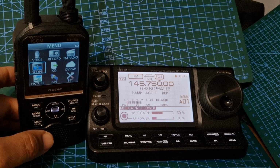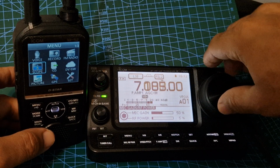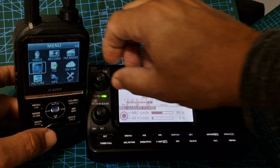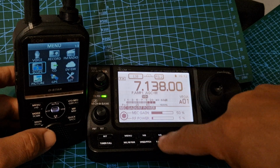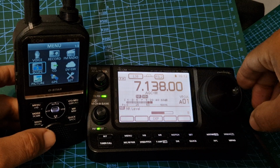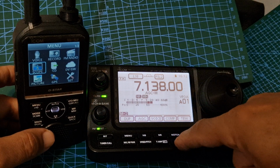So what's it like on HF? Well, I would say that it's as good as your antenna, of course. We just go to VFO. I do find that anything I put on this desk will just bring in noise. Turn the preamp off. For the first time, Maurice, and I hope to meet you on the band again. Noise blanker on. Hold down noise blanker, and you can turn that up. Many thanks for your patience and my very poor French. So back to you, Maurice.